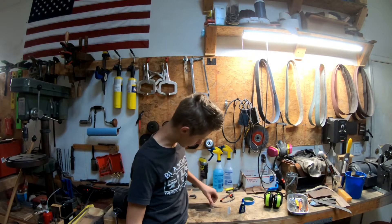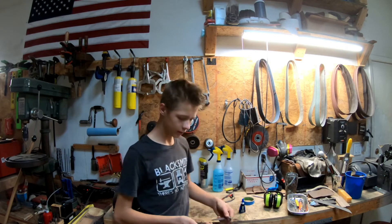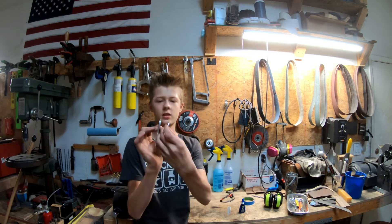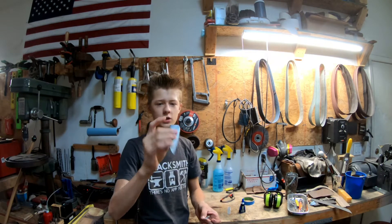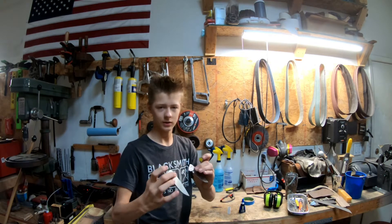Hello and welcome back. It's great to have you here because today we are going to keep working on the folding knife. It is about twice the thickness it needs to be and a little bit proud of the dimension back here. So first I'm going to make this exactly how I want it and then we are going to thin down the width. Throw a fresh 36 grit on the belt grinder and start grinding on it.